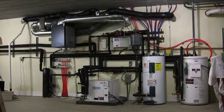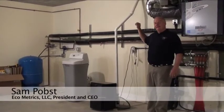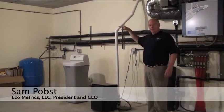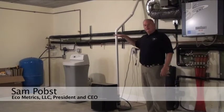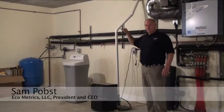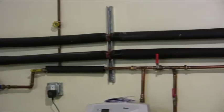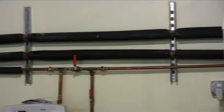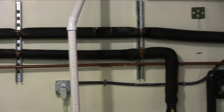These two black pipes go out into the front yard through that wall, and we had a horizontal drilling rig which drilled pipes into the ground horizontally. We have two loops that go out into the yard that are about 250 feet long, and they're filled with glycol so they won't freeze. They're about 25 feet deep, so there's not much chance of them freezing anyway.